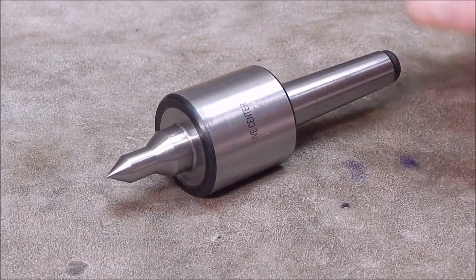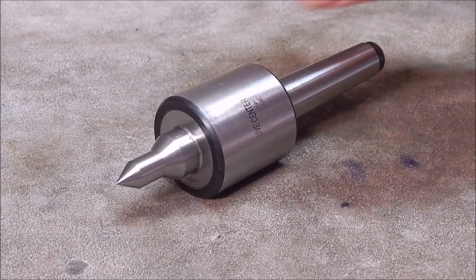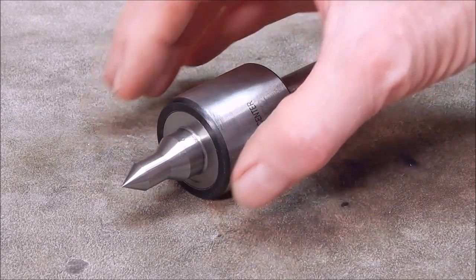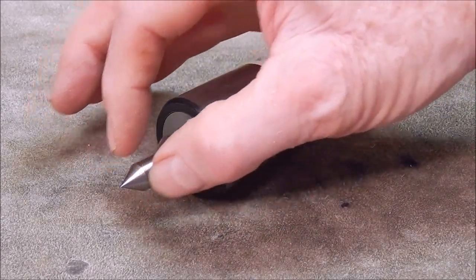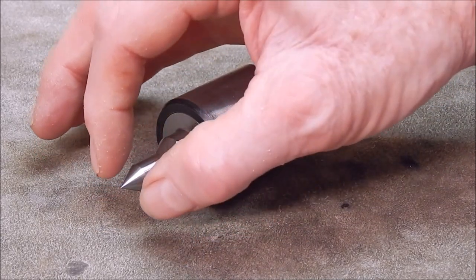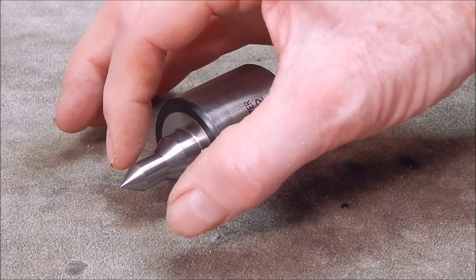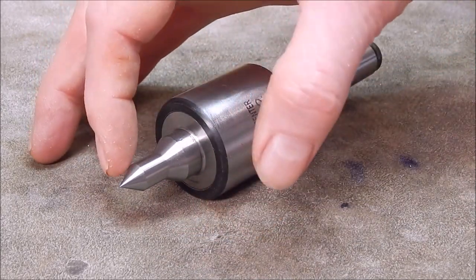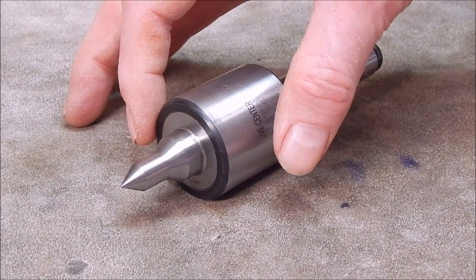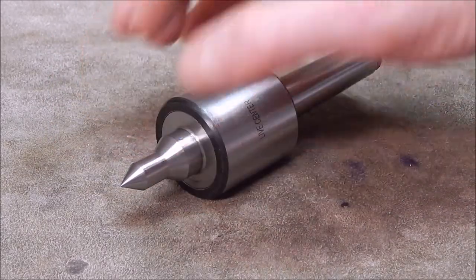Now, they say that this is designed for CNC lathe work. Well, that may be the case, but there's nothing to stop you using this design in a normal lathe. And as I said, the clearance issues are the major advantages with this type of centre. Small diameter, slightly longer nose, and reduced cone shape, so it's like a stepped cone in effect, whereas it would normally come across on an angle to the edge. Basically, that doesn't happen, so the centre cone is quite a lot smaller.